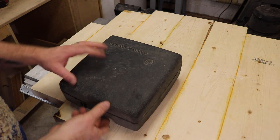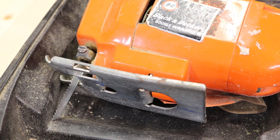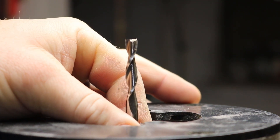You can actually choose to use a jigsaw for this and it would work, but your mark is going to be not a perfect circle. It's going to be really rough and you're going to have to do a lot more sanding afterwards. So if you have a router, you can put in a half inch router bit called a spiral bit or an up-cut bit — it's like a drill blade but it cuts — and it will work really well.